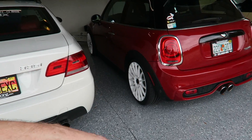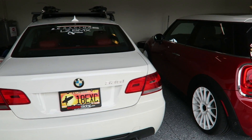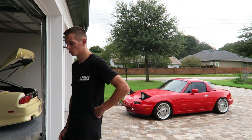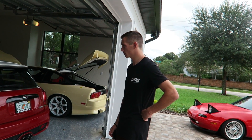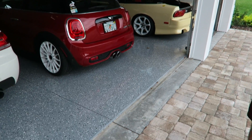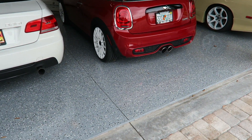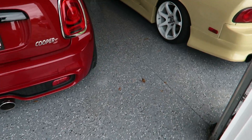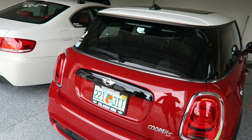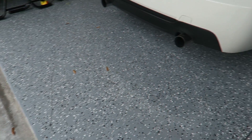You know the typical chip floor system — you know why they do chips? It's to help the compound retain better? No. The reason they do it is because if you just roll out the floor it looks like crap — you see all the roller marks, all the lines. The chips are just to take your attention away from the crappy way the floor looks. It doesn't self-level. I learned that because we did it without the chips and it was all funky looking.